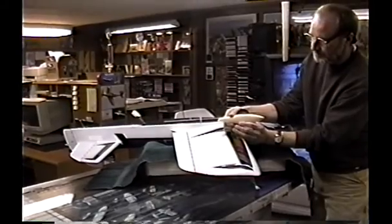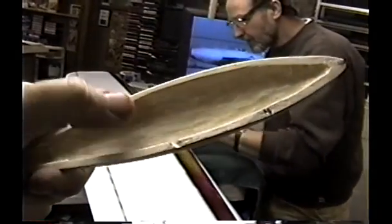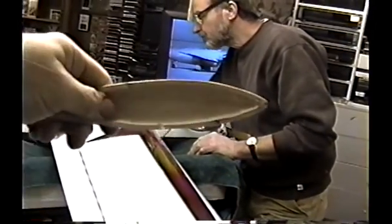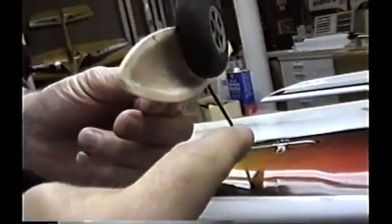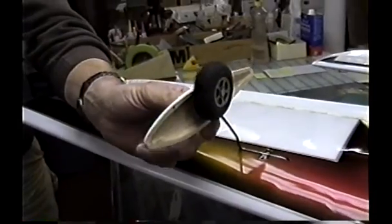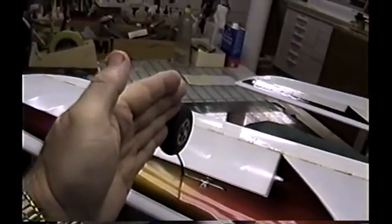Okay, now we'll take a little impression of that. We have the two little dents where the wire wants to go when this is level. So we have a reference now so that this doesn't wind up pointing down or pointing up. Notch that out, and now we're gonna notch this side so that that slides over so it's right in the center of the wheel. Take that off for now, and you can make that notch. See where that notch is? Just notch it in a little bit wider until it's right in the middle of the wheel.